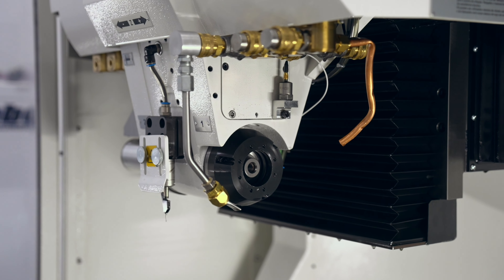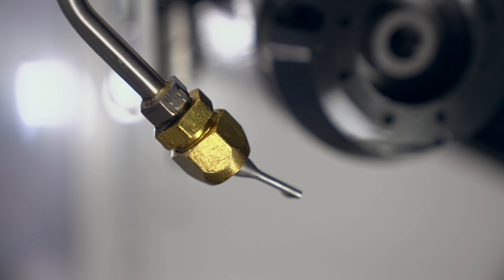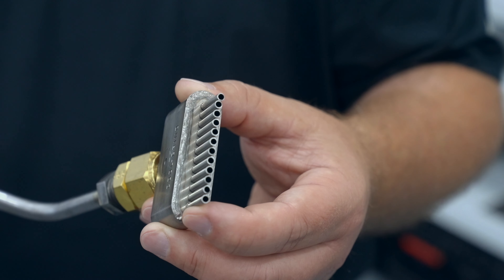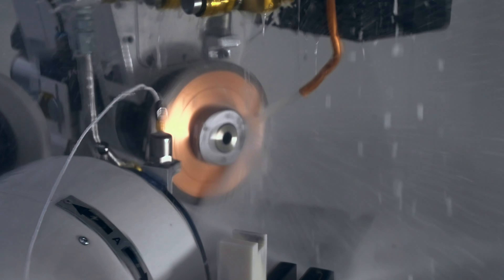The simplest way to optimize velocity and flow is by using nozzles. For many grinding applications, standard jet nozzles are sufficient. However, grinding wheels come in different shapes — some are flat, while others have a radius profile. In many cases, it is more effective to utilize nozzles and coolant lines that have been engineered, designed, and tuned for specific wheel types. This will ensure the coolant is being delivered at the appropriate velocity and flow, but also in the appropriate position.